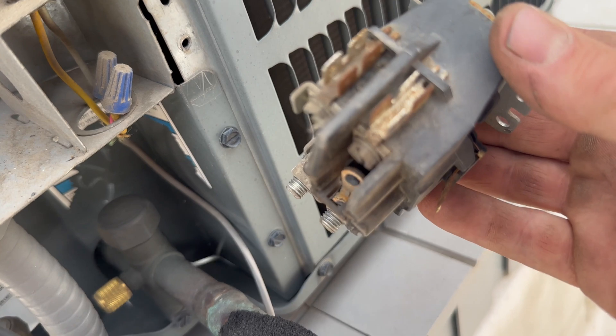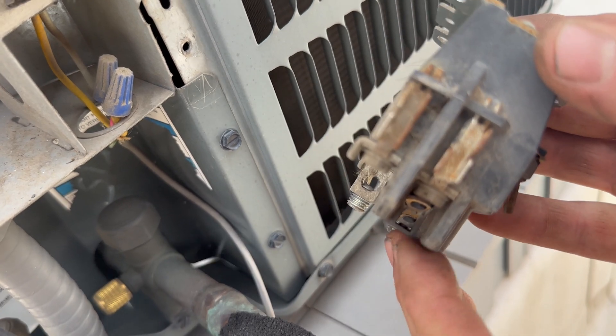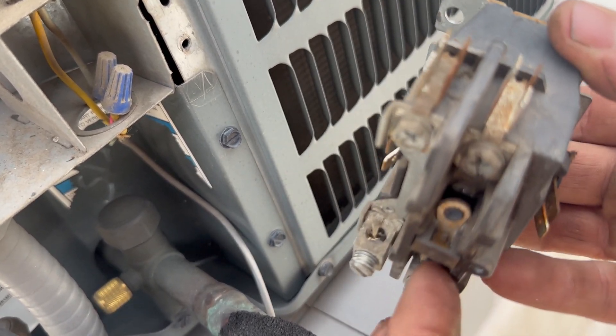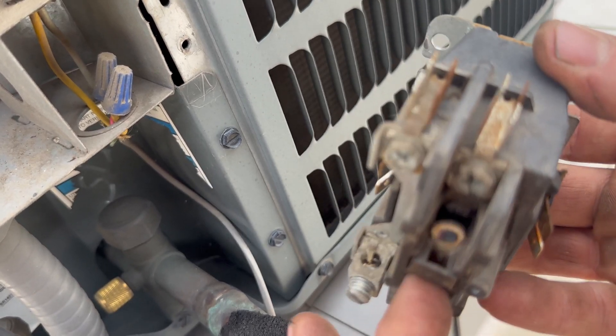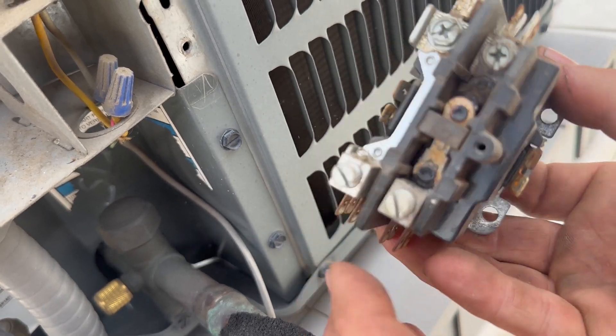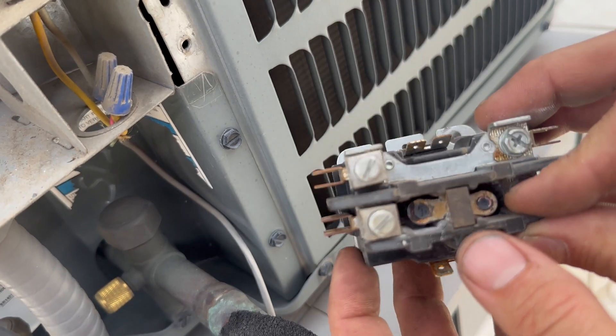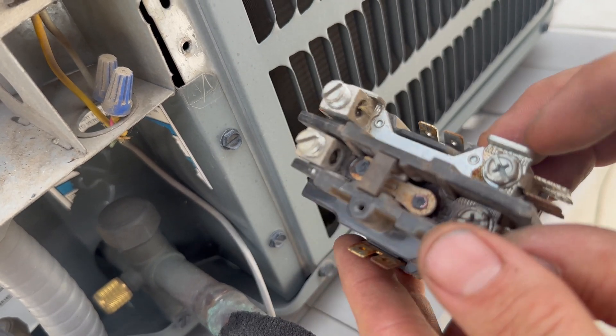Now this isn't a pitted contactor, but it does definitely have electrical damage. You can see the contact plunger is not tight anymore — it's wobbly, it's broken. When the plunger is pulled in, it does not make contact; it's just sitting there dangling. So this is more of a contactor that is just jacked up. Even though this is for entertainment purposes only, maybe it helps some of you guys out. Let me know in the comments if you want more content like this — more simple, basic tutorials. I'm Dave, see you on the next one.